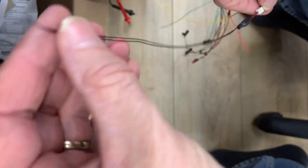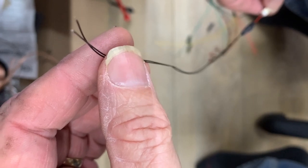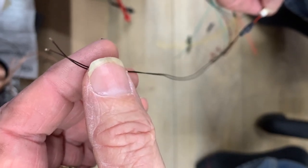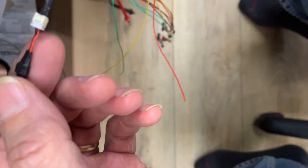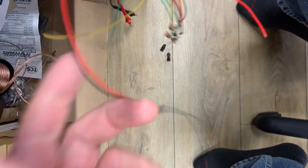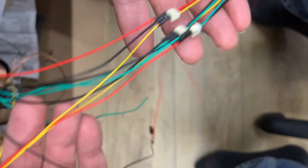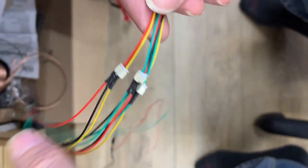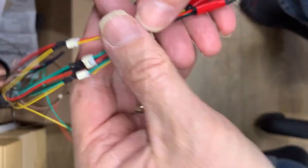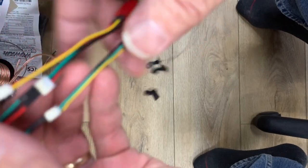And then of course here's the power, which I take off the rails, DCC. You just have to solder these to the rail, or in my case, I put them on my bus line underneath the table. And again, this one has a two pin Molex connector, black and red. Can't get it backwards. That's it. So it's pretty straightforward device. Okay, like I said, I'll unplug these three, and drop them down in the layout, and they'll just hang down from the bottom of the layout for now.